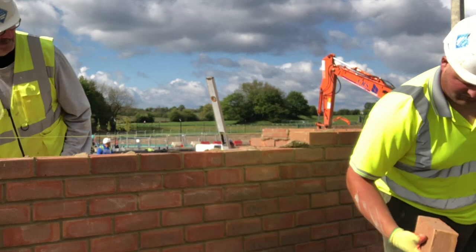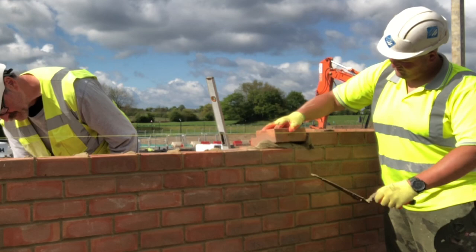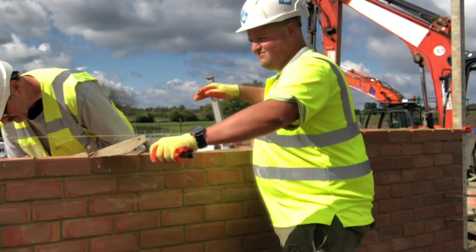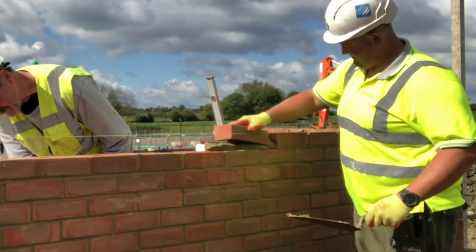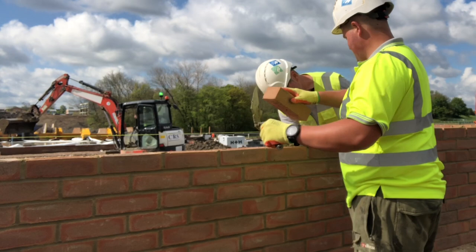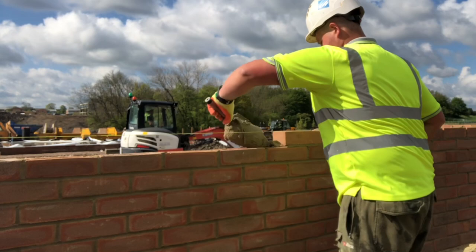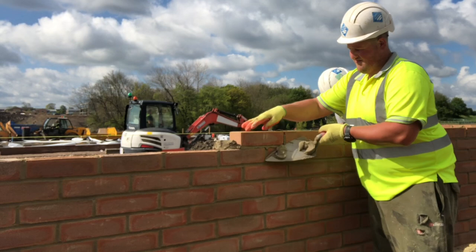Before, when trying to put a profile straight off what the ground workers have done, it's three courses in and running a mile out of plumb. To be honest I don't even blame the ground workers, because sometimes when they've built the garage footing and poured it the day after — a lot of firms use ready mix for the ground works — it can just be rough work. On this particular garage it was a bit tanked, and the ground was really high, which was difficult. I prefer it when there's only about one brick showing out of the ground.